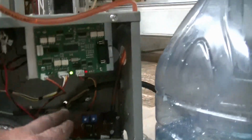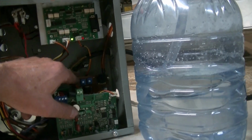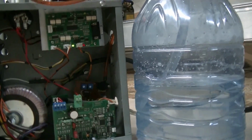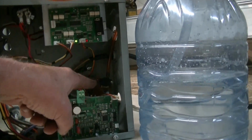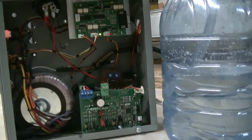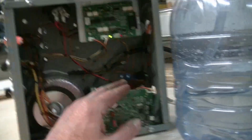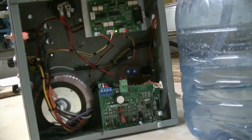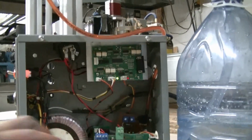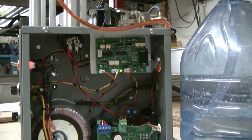Now in here I have a pressure sensor board. It's just sitting in there right now. Actually, I haven't bolted it down, but I'm still working on that because I don't have the right pressure sensor. This is a high pressure one. Actually, I used to build turbo boost controllers when the Fast and the Furious phase was on, I was into turboing. So that's more of a 30 psi boost one, but it doesn't read. Now we're running here under 2 psi at the max. I think it's 3/4 of a psi to push up your lungs. It might even be a lot less than that.